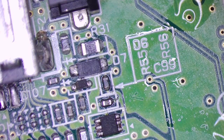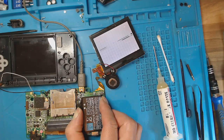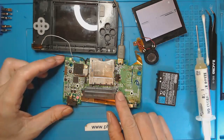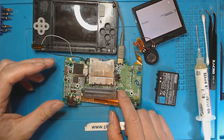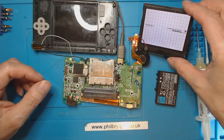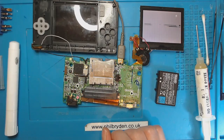There you go, that's on - and I shouldn't have continuity. No continuity! What does that tell you? Working top screen - it's booting up, it's working! I've fixed the bloody thing! So quick recap: the unique part I had with the board was some corrosion on capacitor 99. I've swapped capacitor 99 with a spare board and now we have power. That's fixed!